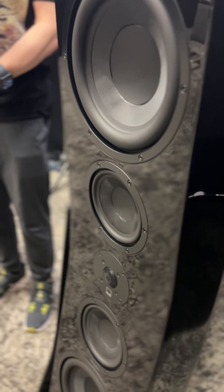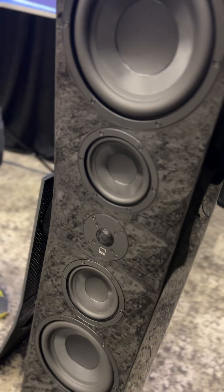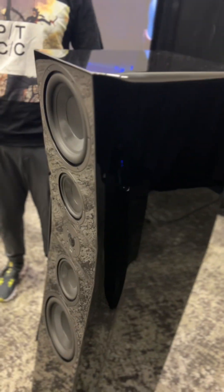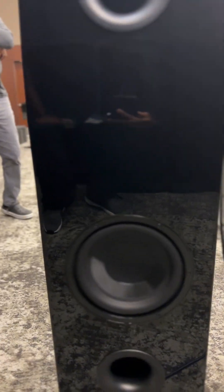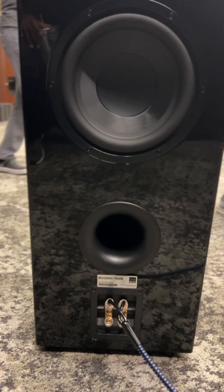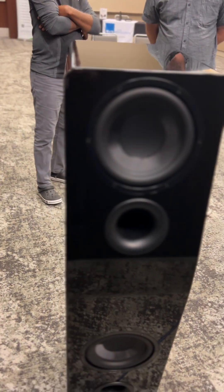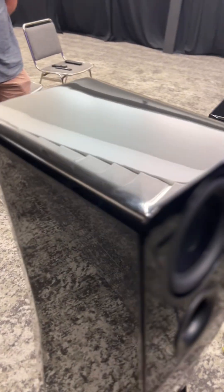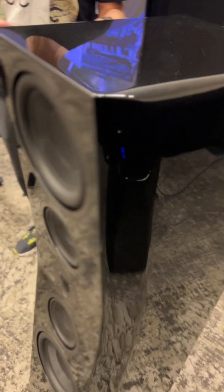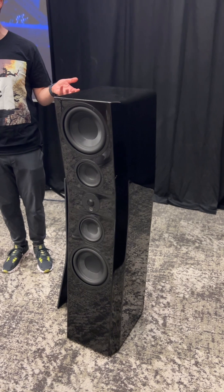The mid-range drivers are in their own sealed sub-enclosure — that's best practice. The dual-opposing drivers use the rest of the cabinet volume, so there's no sharing of air to influence the performance of the mid-range driver. The dual-opposed array uses the back, effectively making this two speakers in a single cabinet. Because of the curved back and the dual-opposing array, we actually correct room modes, so you don't get dead spaces in low-frequency response or uneven sound patterns in a room.